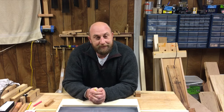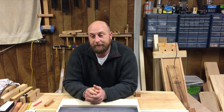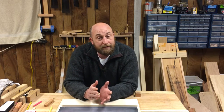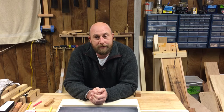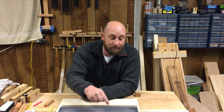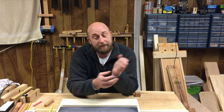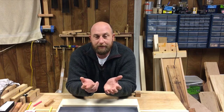Turns out the octagonizer is really just a proportional gauge. So if I simply add a pin 1/7 from one of the guide pins, I should be able to taper every leg proportionally by 1/7 on each side, which will ultimately give me a proportional relationship from 7/7 to 5/7 on every leg I make. And here's how it works.